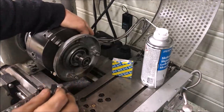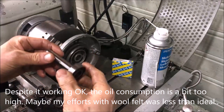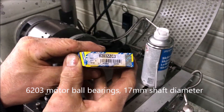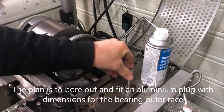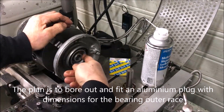So maybe a capitulation. Despite the efforts I made and it working well, the oil consumption was a bit too high, I think. So I decided to replace the plain bearings with ball bearings — 6203, 17 millimeter shaft. That's what I'm trying to explain here.